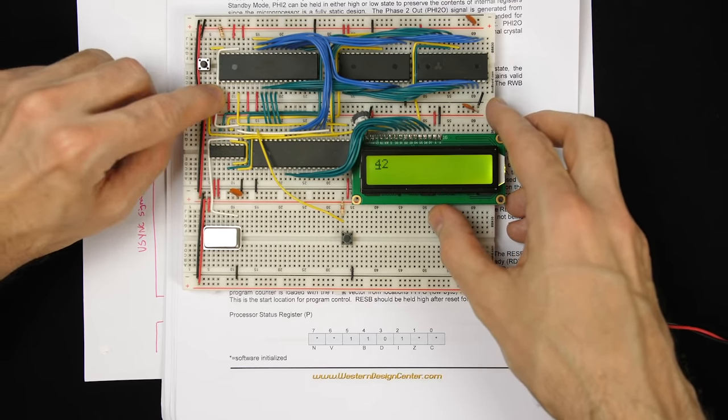The RAM will then put the pixel value out on the data bus — the blue wires — and we need to get that pixel value back to the video card to feed it into the resistor divider network here, so we can put out different voltages for red, green, and blue to display the pixel on the monitor. I'll get rid of the NAND gate that was used for the EEPROM control logic since we don't need that anymore. Similar to what we did with the address bus, I'm going to use another 74HCT245 buffer for the data bus.